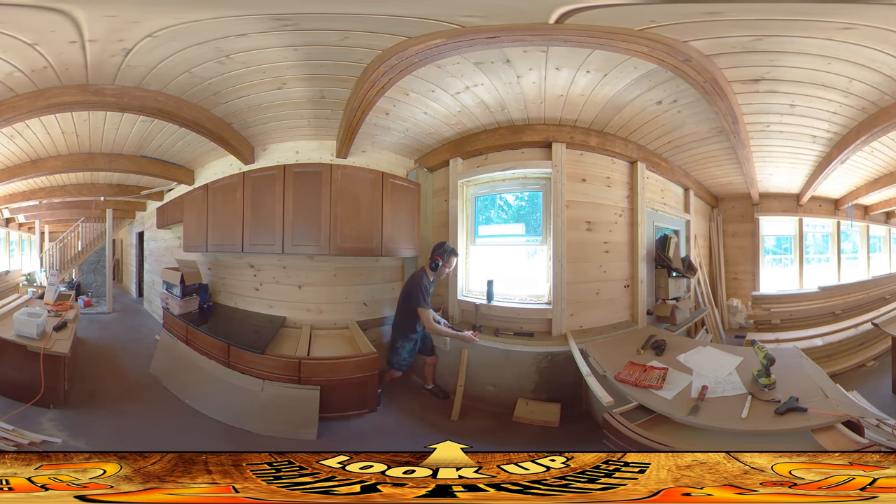Before I do this, I've got a little brace because I've got a line scribed here — I can't just hammer this in anywhere, it needs to be at the correct height. I'll hold it up there with my hip, make sure the charge is still in place. Okay, it didn't sink all the way — this concrete wall has been curing for a long time, that's not unusual. So I'm going to tap it the rest of the way in.